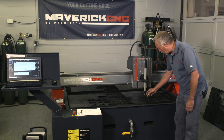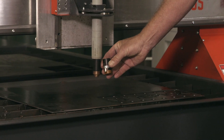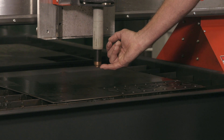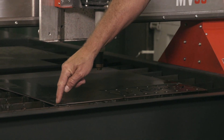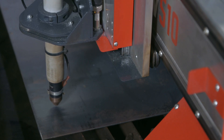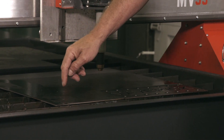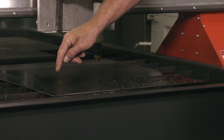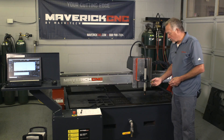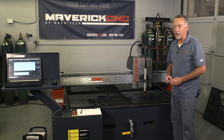With ohmic sensing, which is on all the Maverick CNC machines, you'll have a cap on here with a wire connected to it. It uses a very light touch with electrical contact — ohmic contact — that does not deflect the plate. So when it retracts to the pierce height, it's at a very accurate height. That dramatically improves consumable life. And there's a secondary benefit: because it knows the exact height it is off the plate, when it indexes down to cut height and starts cutting, it's at the correct cut height too. So ohmic contact is a much more accurate means, and an integrated torch height control is the way to go for CNC plasma cutting.